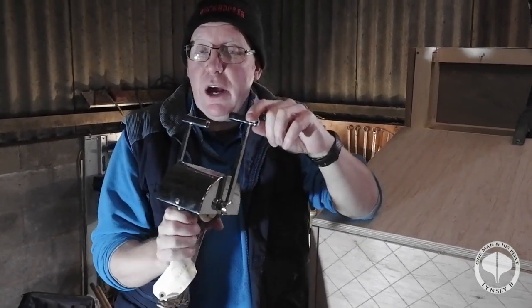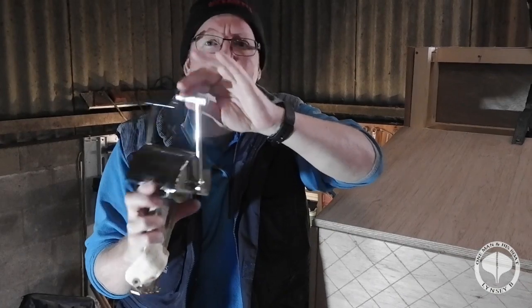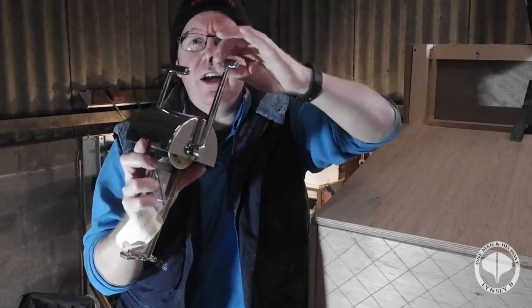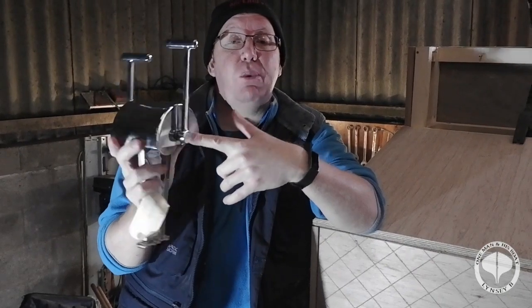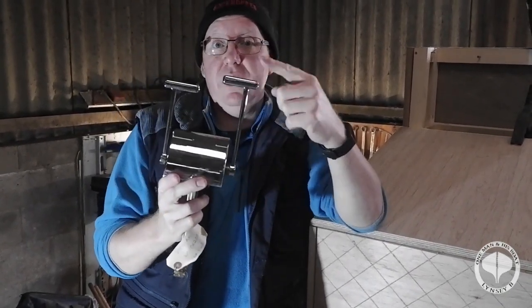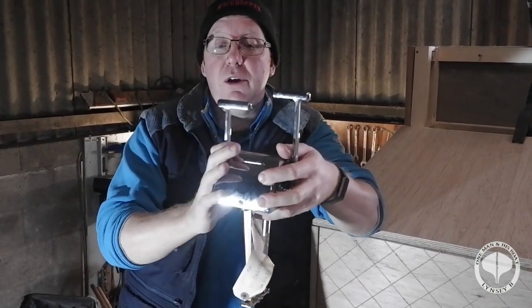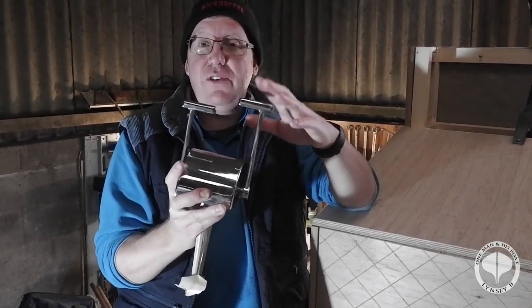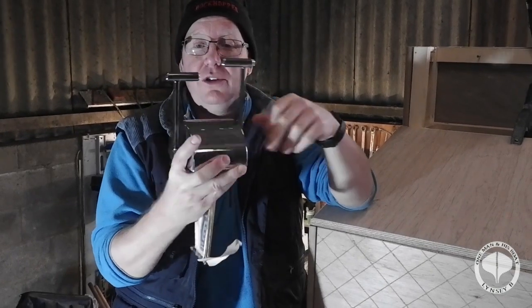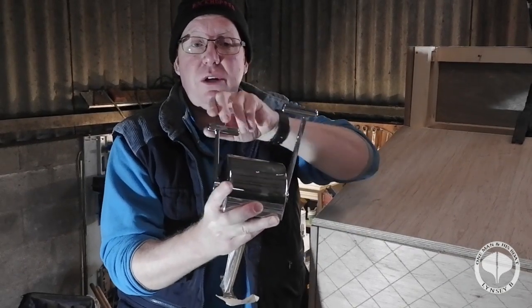Now, what I figured out is this taller handle is actually the gear lever, and it's all because of this. Did you hear it click there, in the middle section? It's got a small click. Now apparently that's a safety thing for when you're in neutral. So you can tell that this is the actual gear side and this is the throttle side. Now if I'm wrong, please guys, please shout out and tell me otherwise. But by the time I get this message, I'm about four vlogs ahead of you, so it'll probably already be fitted. However, the thought's always there, eh? So, as far as the online goes, this is the gear side, the one with the taller handle, and this is your actual accelerator, forward and back.